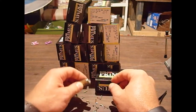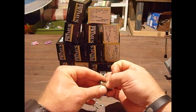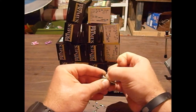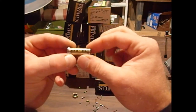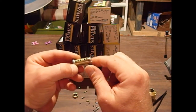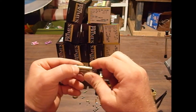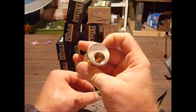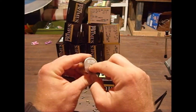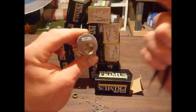I'll show you real quick the zero-bitting - the zero-bitting just means that the key pin goes in, the driver pin goes in, and you're at the shear line. That's how all of them are - that's why it'll just push out the front. Like I said, if you have trouble with it, you can rake it a bunch of times just so those pins all sit down in there. That's how they're all pinned up. So the plug comes out the front, and you can see there's no front of the track for the sidebar. There's no front there, so you can just push it right out the front.